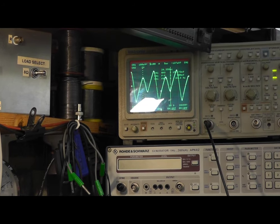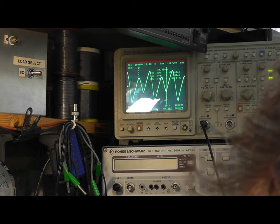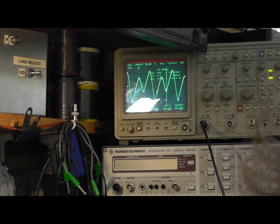Right, this is a low tension supply that's actually smoothed and supplies some of the valve heaters. It's a minus 24 volt biasing supply. It consists of an electrolytic can with three 600 microfarad capacitors in parallel, basically just a rectified supply. And this is what you're seeing on the ripple. So bear in mind this is a 24 volt supply, and we are on 100 millivolts per division. You can see we've got about 500 millivolts of ripple, which is fine. The only slightly strange thing is that it looks like the selenium rectifiers are starting to deteriorate, though they're clearly working okay at the moment.